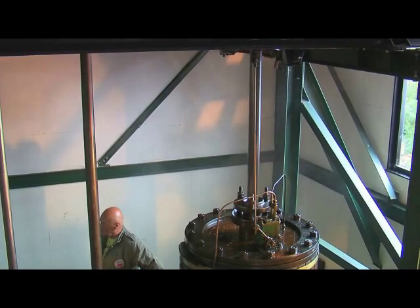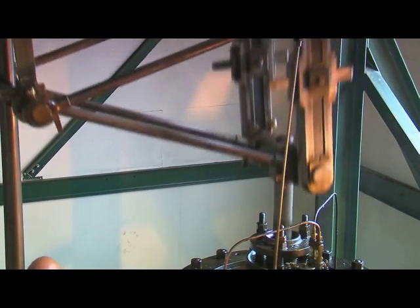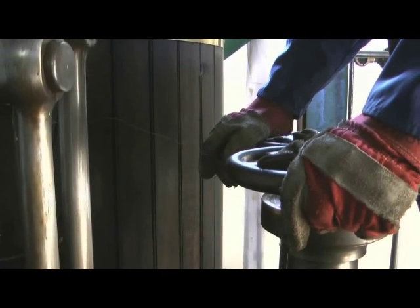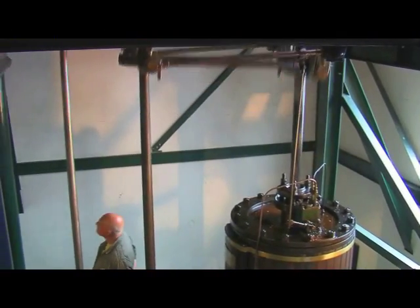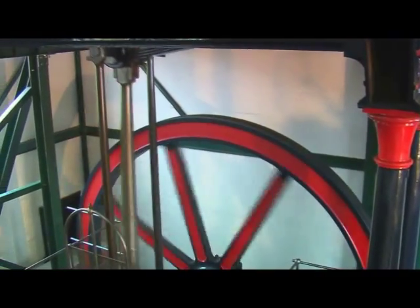It makes running a beam engine quite tricky because it has no load on it, so it either tends to accelerate or stall. I'm having to just control the vacuum with this little piece of wire in my right hand, just to stop the engine overrunning. As you can imagine, a beam weighing ten tons, which changes direction in a second, is a huge amount of lateral force to the engine. When you think it's only standing on two cast iron columns, plus the struts that we put at each end, you need to run them really carefully.